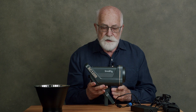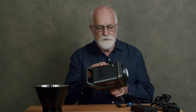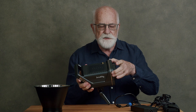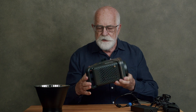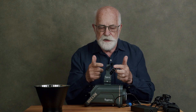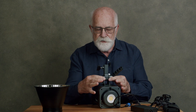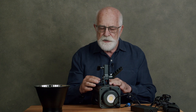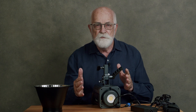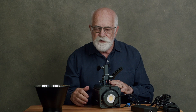The light has certainly got a quality feel to it. It's made of quite good quality plastic casting for the most part, but the front plate here is metal. Underneath, this is all cast metal, as is this part. This is also a casting, which has its advantages but disadvantages. If this was a piece of folded sheet metal, it might bend possibly, but it wouldn't break, whereas this casting could break or shatter if struck.